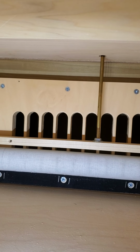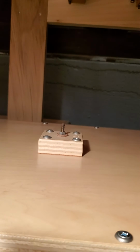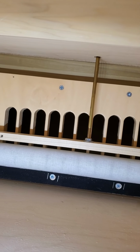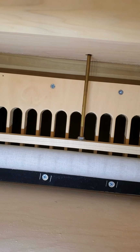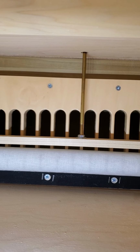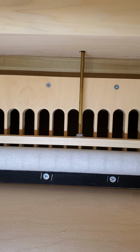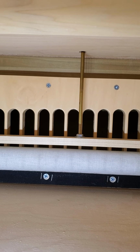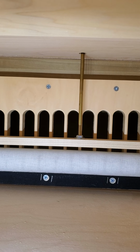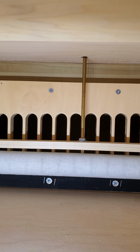That brass rod goes through the lid of the smaller inside box and then out to the top of the main reservoir, where you can adjust the length of it so that that roller that holds the rubber cloth against that grid will have the right amount exposed when you first turn the organ on. So when wind first comes in here, the valve is going to be in the position that it is now. The lid of the reservoir will inflate because of the air pressure. The springs will hold it at the right pressure, and that brass rod will go up, pulling the whole roller with it and shutting off the grid partly or mostly.